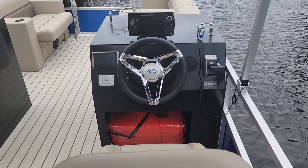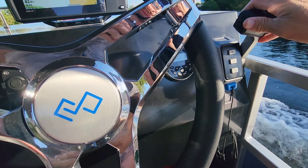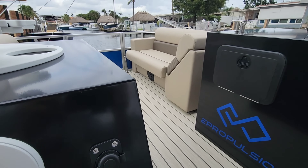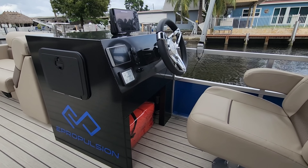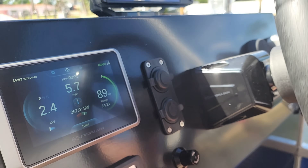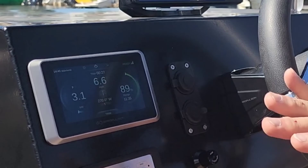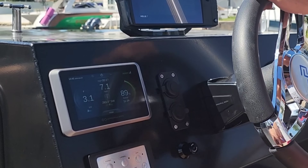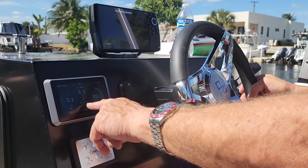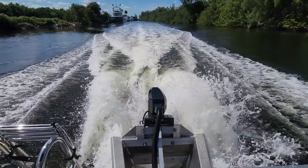So what's the runtime and speed? We know that the electric outboard runtime is dependent upon your throttle input — the more power you draw, the faster speed you can go and the less runtime available per charge. ePropulsion designed their 400 amp setup to give you one full hour of full throttle continuous runtime. The LED touchscreen display gives you real-time diagnostics and trip expectations based on your power draw. We were drawing 3 kilowatts of power, cruising the 22-foot pontoon with 4 guys at 7 miles per hour, and with 90% battery we had an estimated 11.5 hours runtime at that speed.